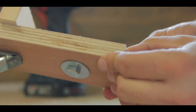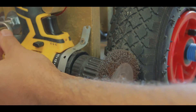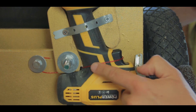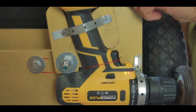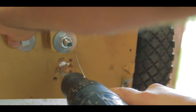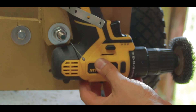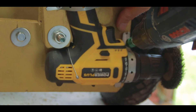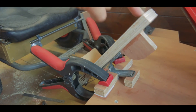The gas pedal only has one function, and that is to pull a wire through the go-kart to the back where, as the gas pedal goes down, it squeezes the trigger on the screw gun and the whole machine gets set in motion. I tried a few different wires but ended up landing on the grey brake cable, which ended up working the best. I had to make a hole in the back for air to be sucked in through the machine so it wouldn't get overheated. And there you see the gas pedal in action.